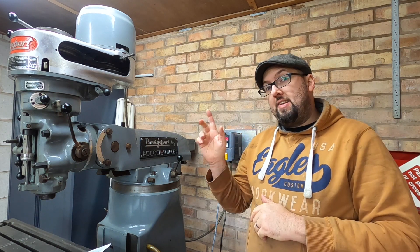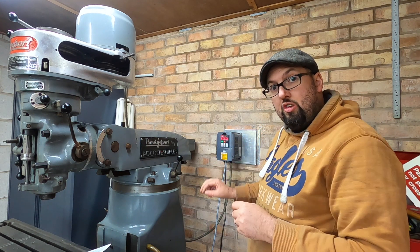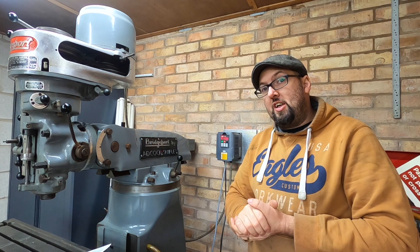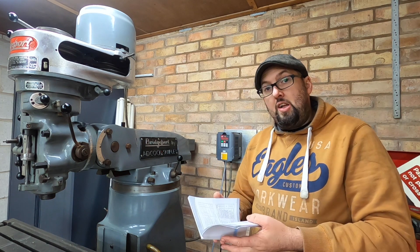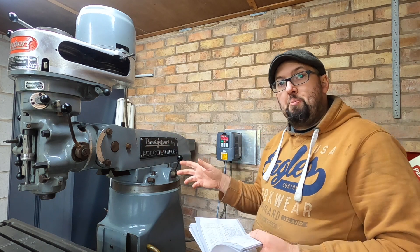To get this motor running through a VFD using the three wires, you need to set the VFD to 50 hertz. As it comes supplied, it's set to 400 hertz. If it's the Huanyang, go to preset 13 and set it with the up and down arrows to eight and click set — it will reset the parameters of the entire VFD and revert it back to 50 hertz. If you do a quick test it should fire up, but there are settings you need to go through in the manual. You need to input the details of the motor into the VFD so you don't burn out the VFD or the motor.